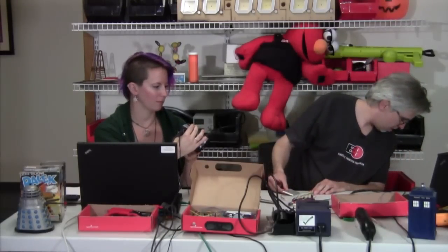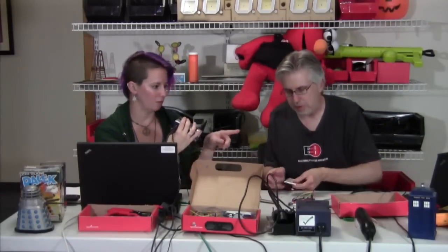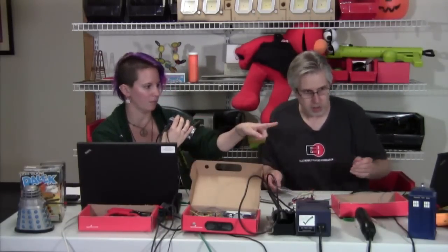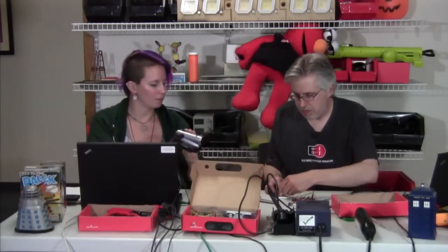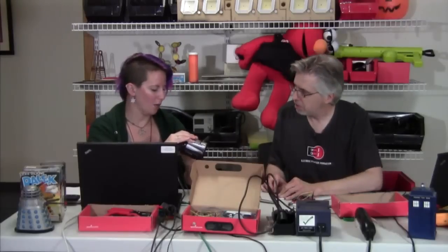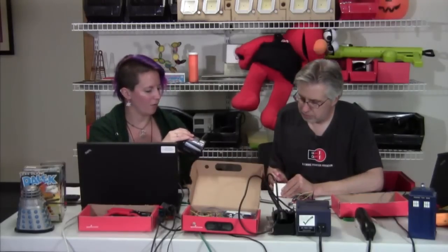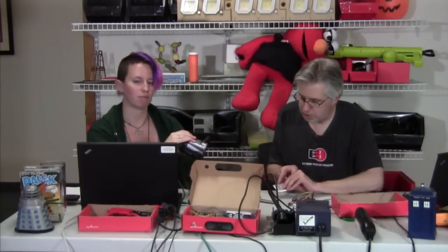And if I had some tape, I would strain relieve this now, but I do have hot glue. Should I bend it back and glue it to the thing or just put some dabs of hot glue down there? I personally like to leave as much battery wire for myself as I can so I don't end up yanking on it. I would just cover it up there.